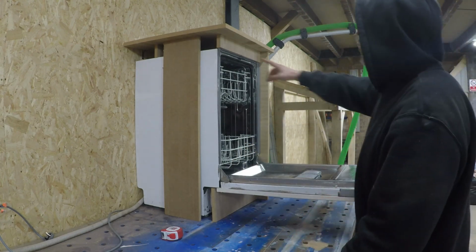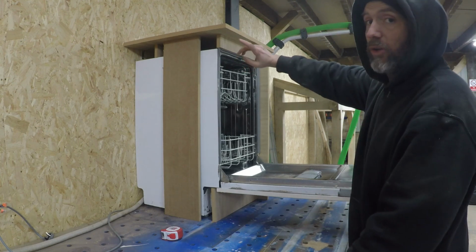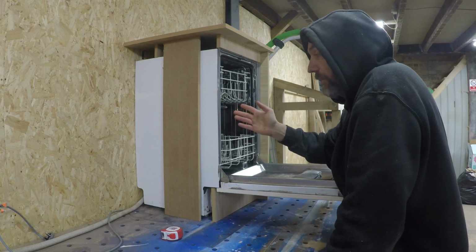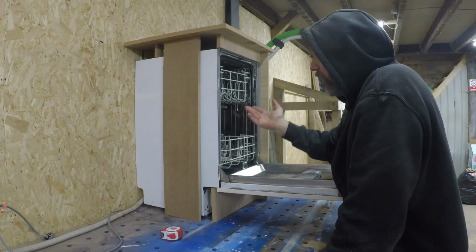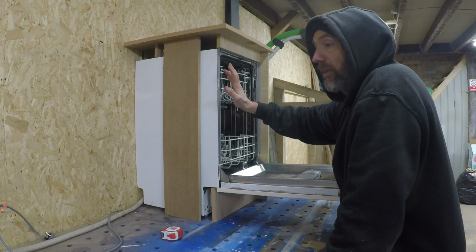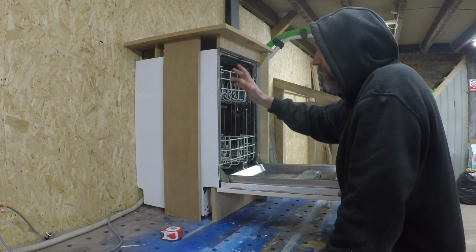So what you have got to do though is address this at the top. I normally do that with my kitchens with solid wood. But if you were fitting a kitchen like a Howdens or a Wren, you could just use the offcut of a shelf. There's always leftover bits, or an end panel or something.